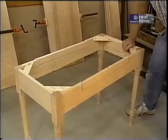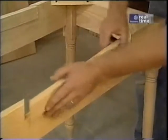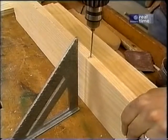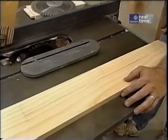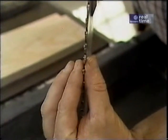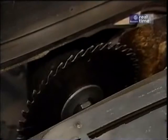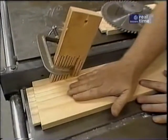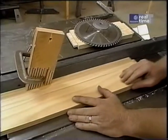Back at our prototype base for the table, the side style and this swing arm are cut out of the same piece, and they're mitered at the ends to act as a self-stop. The first thing I want to do is drill a hole for this screw. Now to make this cut right along the bottom of that support piece, I've got a couple of tricks. I don't want to use my standard saw blade because it has too wide of a kerf — it's going to remove too much material. So I found a blade that's a lot thinner and it's still carbide-tipped; in fact, this blade comes out of my circular saw. What I want to do is slide my piece underneath this feather board, which holds the piece down and keeps it from kicking back. I'm going to raise the blade up slowly through the wood and then push it through to my final mark.